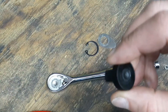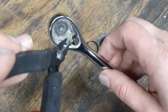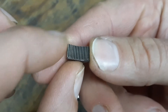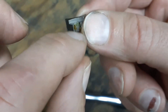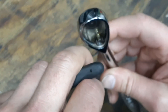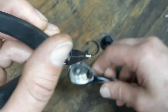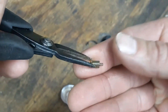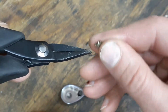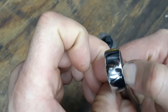It's better than the half-inch drive — that one had a lot of slop. There is some oil on the inside. Here's the pawl, identical to the half-inch drive with nice teeth. The groove on the back of the pawl sits on the back of the ratchet body. When reassembling, make sure the numbers face out. Here is the detent with the single spring — same design with the middle piece where the back of the pawl sits. You can then pop the switch out.